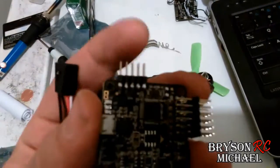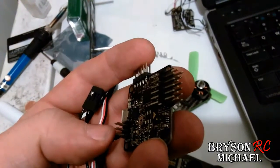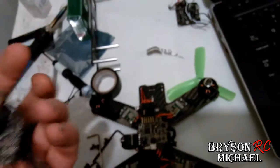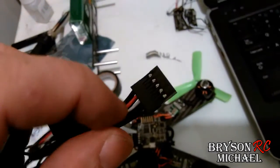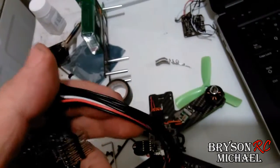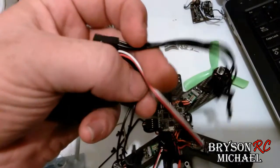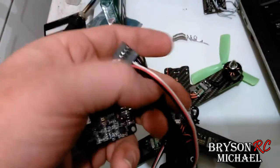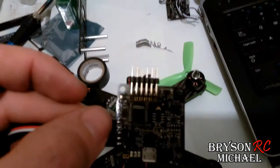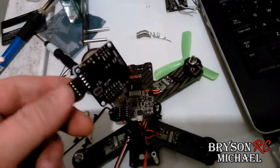You've got these pins here on the side — these are for your ESCs and motors. Then this connector piece right here comes with this big piece; this is for your PPM. And if you want to hook up a different style receiver, it's got all these extra wires right here. That just plugs in right on the side. PPM is up here at the top, you can see your direction there, and you can just put it on your board and start connecting stuff to it.